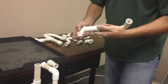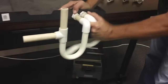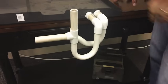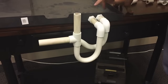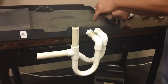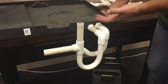You grab a P-trap for the secondary drain and place it so it falls down into the emergency drain pan. Now you have two air seals, and no air is bypassing through either hole — which means nothing is preventing water from draining properly. That's an example of a correct horizontal application by municipal code.